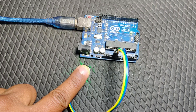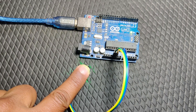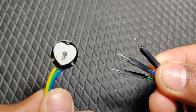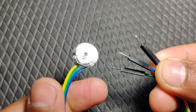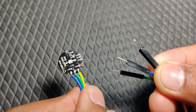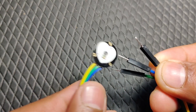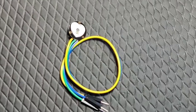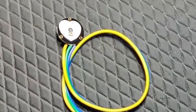So why is our DIY heart rate monitor setup not working? There are two main reasons. The first is that the sensor might be fake or defective — but that was not the case with me. The second and most important reason is that the sensor somewhat works, but it doesn't do what they claim. Let me explain what it actually does.